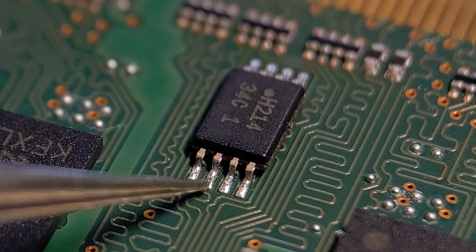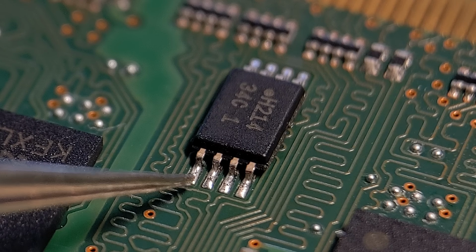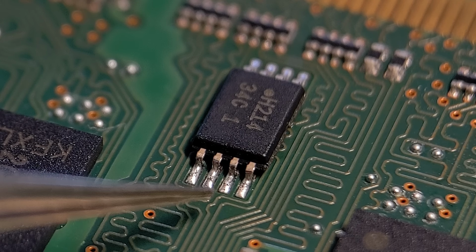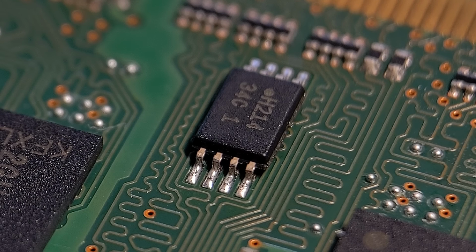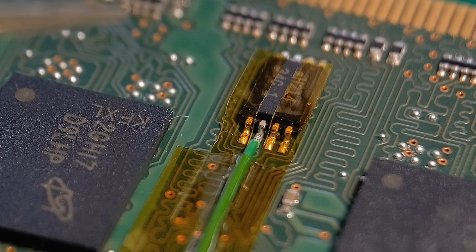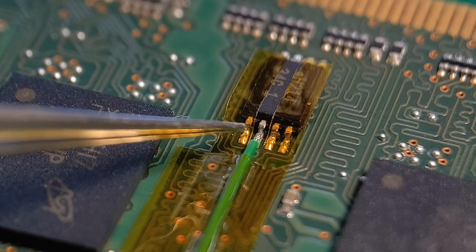Now if I was attaching a wire to this second pin in, it can be fairly easy to accidentally catch the pin either side and form a large short, and it can be sometimes difficult if you haven't got the right equipment to remove that short. Now with Kapton tape, I'm going to hopefully make this procedure easier. So what I'll do, I quickly take this up off camera and then we'll rejoin you when we do the soldering.